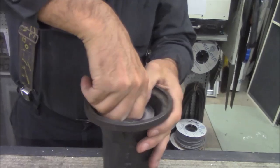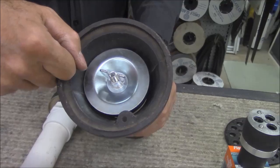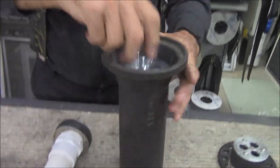You tighten up the wing nut and it's going to seal and stop the water totally. This is only a good idea where the floor drain is connected to your sanitary drain system in your house, so there are no leaks — I don't have to worry about water coming out of the sanitary system going underneath my floor. The sanitary drains in your house are solid pipes; they don't let water out. All the water in there is sanitary water from your bathrooms, kitchen, and toilets going out to the city. This one can be plugged; the other one can't.